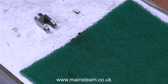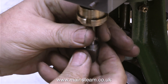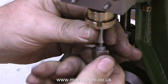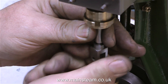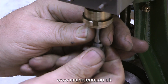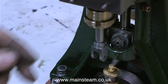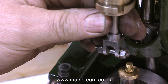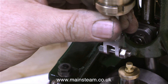I do like doing videos like this now and again — showing how not to do the job rather than showing how to do it. Even though the part looks fine at the end of the video, it's not perfect at all. I had to grind down the outside edge somewhat to get it to look right. I made a cross pin from a piece of 3/16th of an inch diameter stainless steel, and I cut a 2BA thread at each end to take a pair of 2BA nuts. But as you can see from this clip, the valve fork isn't the shape I want it to be, so I will be making another one and I'll probably show that in the next video.